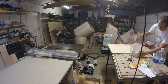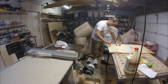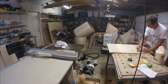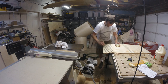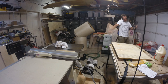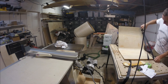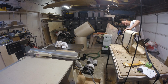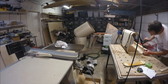Here I'm putting some water on it before I do the bend. It makes it bendable if you put a bunch of cuts, and I've calculated how many cuts it takes to do the various angles. Then I paint some wood glue in to fill the void, so when I fold it, it will hold in place. Getting the straps out, a strap around it — you can tighten the straps up. There's a little bit of variable dimension in the angle, so you've got to be a little careful.